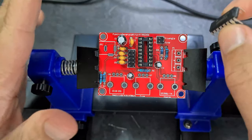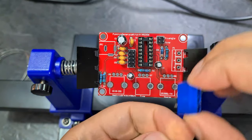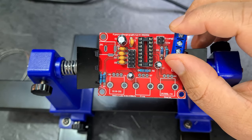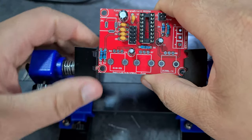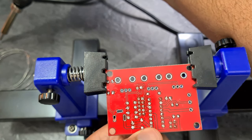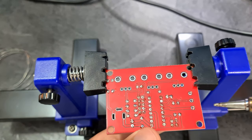I've got this output connector which I think goes this way — just guessing. It seems like it goes here so I'll run with it for now. It's difficult to hold but I'll put one finger under, grab the soldering tip, touch some solder to the pad and make a bond — and then I can let go and properly solder it.